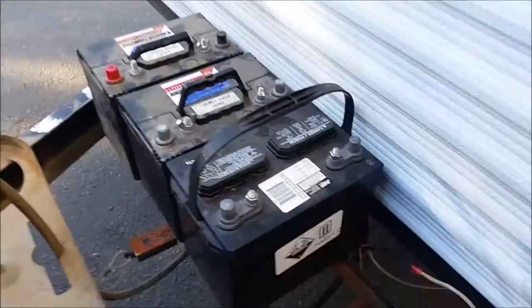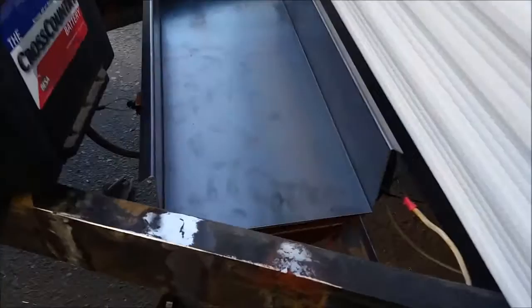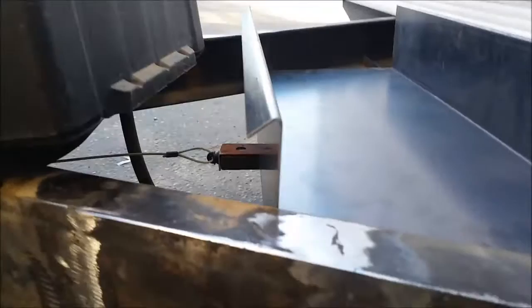It's one-inch by eighth-inch angle and it's already welded in pretty solidly to the frame, so there's no reason not to use it. So let's make up a pan. I've taken a piece of 16-gauge and broken it a little over 10 inches wide. I also put these stiff edges on there to give it a little rigidity.